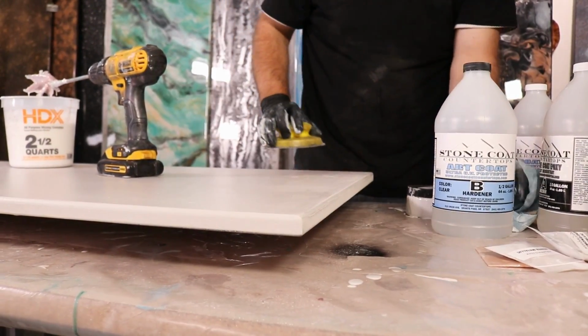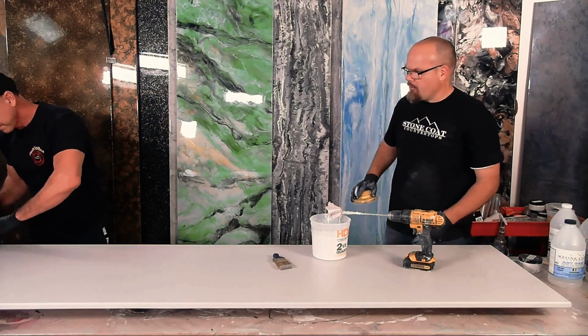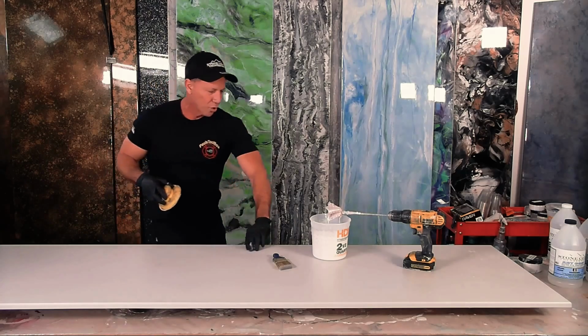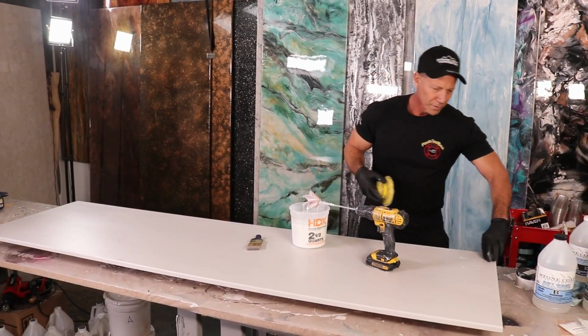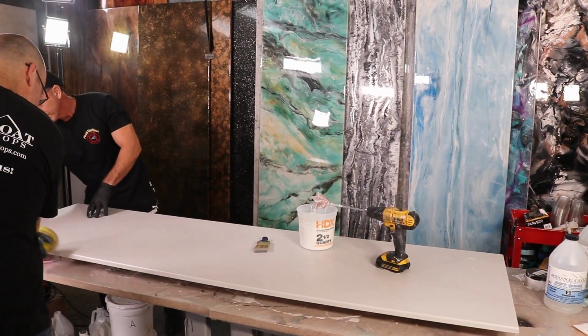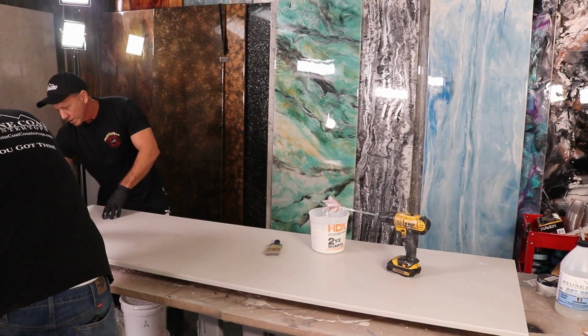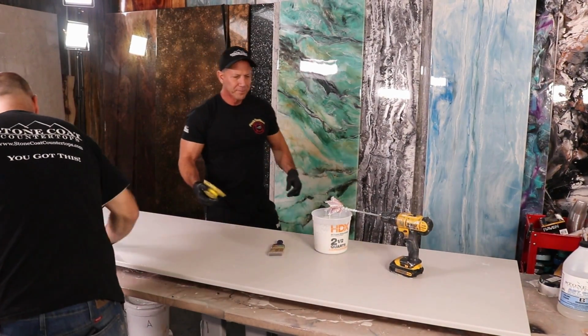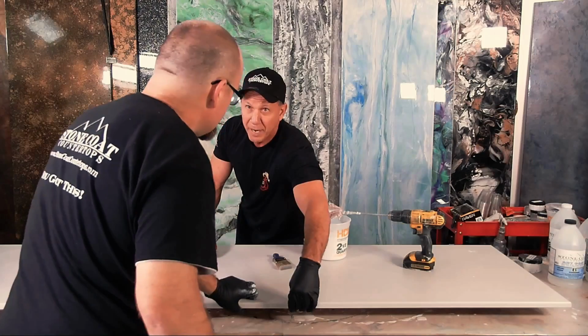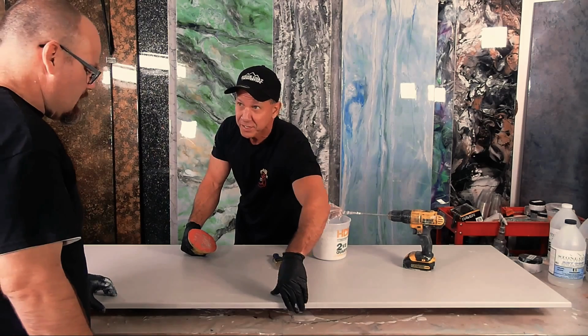Yeah. So, this is just paint and primer in one, 2 coats, and we sand in between coats, 220. Oh, okay. I'll get the front edge here. Not pushing too hard, no pressure. All we're doing is creating a smoother edge so it doesn't have surface tension. I notice here you have a little bit of a round on the bottom of that. Yes, to keep this, what's that?